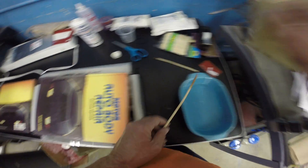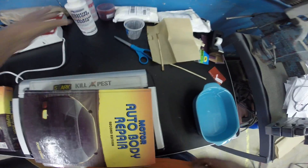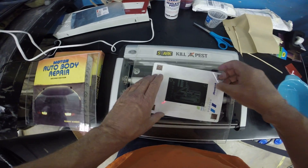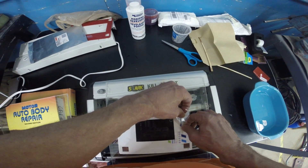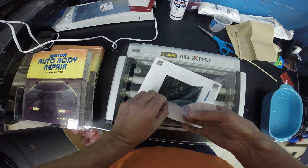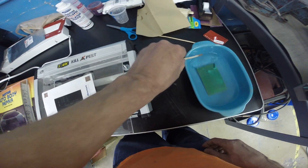Now set that aside and put the lid on the developer. We can take our board and remove it from the template — it's okay if you tear the scotch tape. Now it should just fall right out into the developer. Take a little stick and move it down in there.